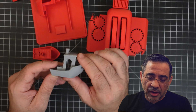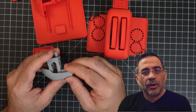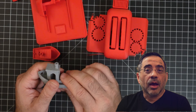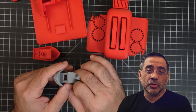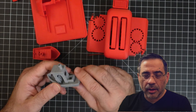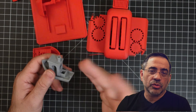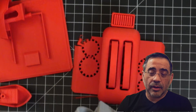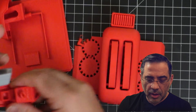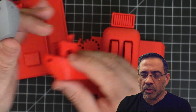This is a really bad benchy. What I noticed after I started running the prints — this was my very first print — is that the print pad was wobbly and shaky. There are no screws to tighten the actual bed from the outside, but if you lift up the PEI sheet there are four screws. I tightened those four screws using the included Allen wrench, and my prints went from something that looks terrible to something that looks great just by tightening that bed.